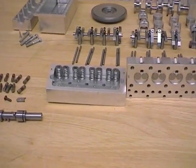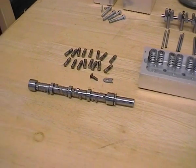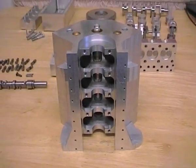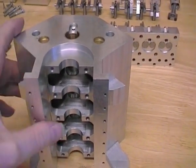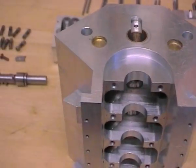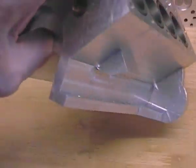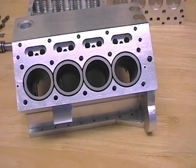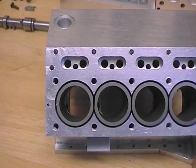Both rocker shafts, rockers, push rods, cam followers, and camshaft are out, which just leaves the cylinder block. This was one square lump of aluminium when I purchased it, and I machined it myself out of solid. I've drilled waterways in there and made some phosphor bronze cam bearings — there are five altogether for the camshaft. The cylinder liners are all in, machined out of EN8. Those are the cam follower guides where the cam followers fit, and the center hole in the middle is an oil return.